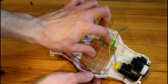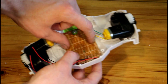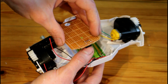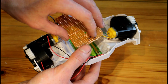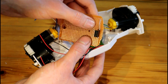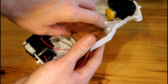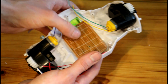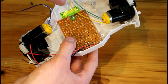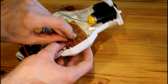The socket for our NRF24 radio module is going to fit through like this, with the header for all other components facing upward. The copper is on the bottom; I've put the legs of the socket up through the perfboard, bent them over, soldered some old component legs to them, and put them through to fix it in place. That's working well, and we'll be able to solder sockets through and plug in our components on this side. I'll screw this in place and show you where the NRF24 will be sticking out.